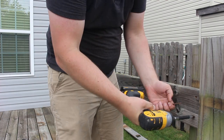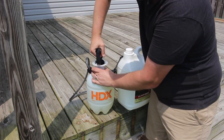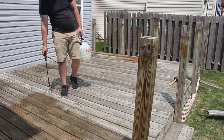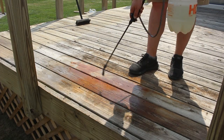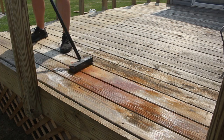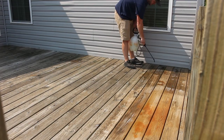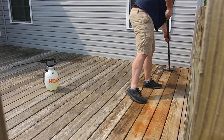While these old railing boards are getting tossed out, I am going to try to save as much of the wood on this deck as possible. So before stain, we're going to clean it all with some deck cleaner. This is a really simple process — just spray a generous amount all over the deck and then use a stiff bristled outdoor brush to brush it deep into the wood. This will clean any dirt, grime or old stain out of your boards and get your deck looking nice and clean before stain.